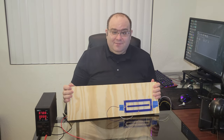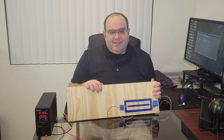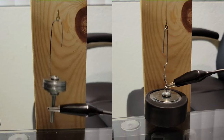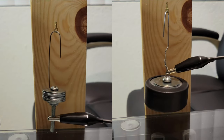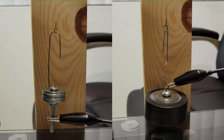The last thing I did was change the thickness of the muscle wire. These 6/1000ths of an inch wires have much more mass than the 3/1000, so they heat and cool much slower, which will help create the slow and gentle movement I was looking for.